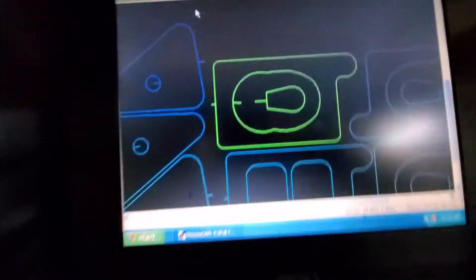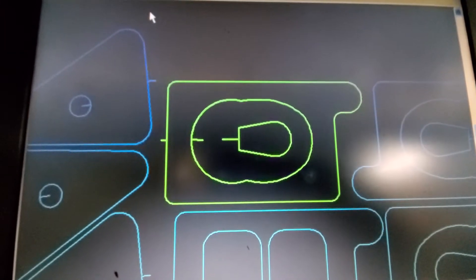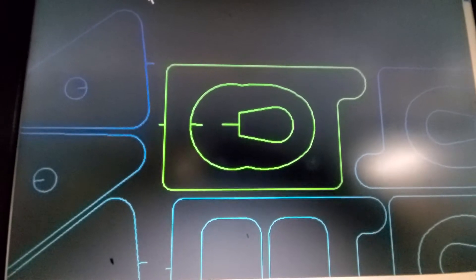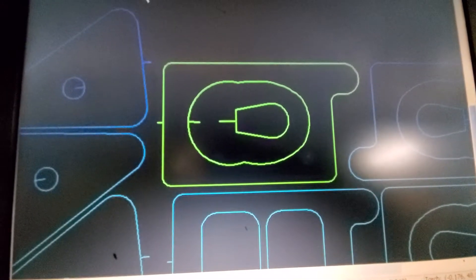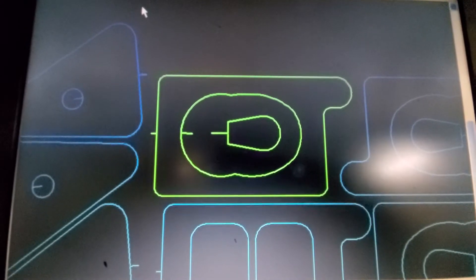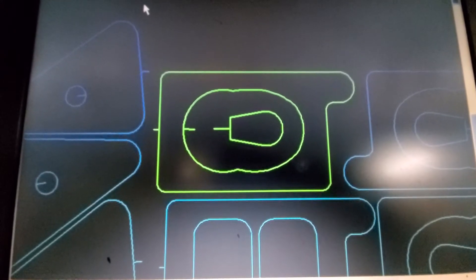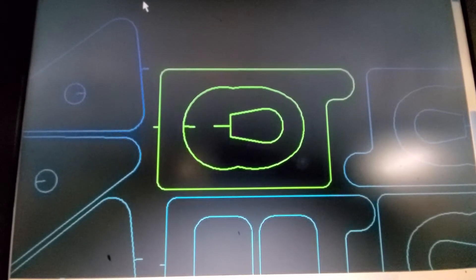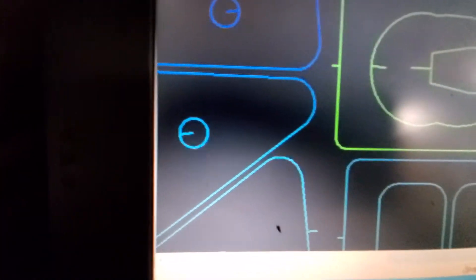This is a turbo flange. For those who don't know, the cutter is a Hypertherm 1250 — this will definitely pierce half inch metal. Inside this flange, that would normally just be a chunk of extra metal, so I cut this extra piece inside there which is a mount that I use for something else, just utilizing a little bit more material. There's no bolt holes in here because, as I posted in one of my drilling videos, with the Hypertherm, unless you have a high definition plasma cutter, laser, or water jet, you're not going to get bolt holes — 3/8 bolt holes in the flanges. These are 5/8 right here and they come out pretty wonky.